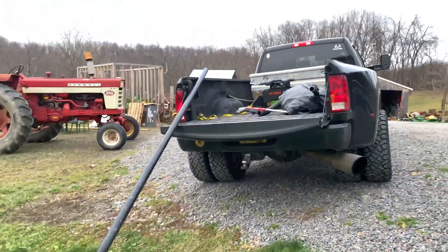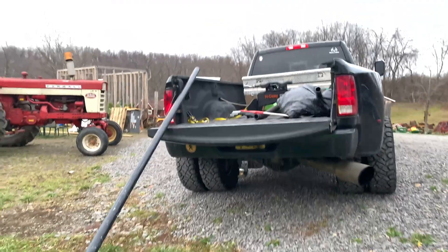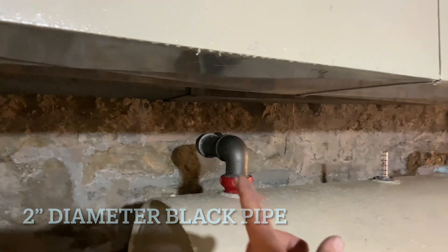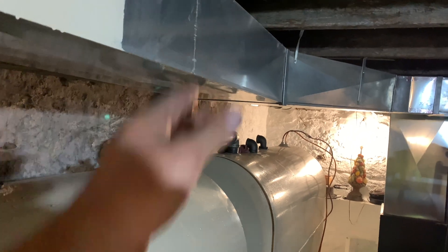We're taking the two-inch, 175-inch nipple in, so we're going to have to wiggle it through there. We got some twists and turns. We got the 76-inch nipple and a couple other little things. This long nipple is actually the vent nipple — it's going to stretch all the way from the vent far end all the way to the wall. I'm going to have somebody on this side helping me, hand screwing it in, and then block it up and strap it up to the joists. It's a pretty heavy piece of pipe.